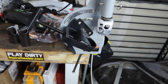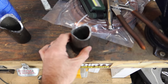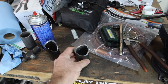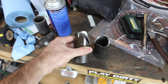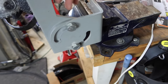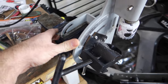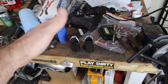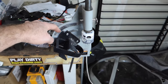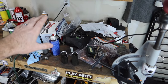I've been making a bunch of notches with it working on the cage for this car and it has saved me a ton of time. I actually went through and made a bunch of templates — I had some extra tube lying around and I made this as the 90-degree, which is just a straight cut, and this is like a 40-degree I believe, and then I made another one that's like a 35. I'm actually using this in a vise. The way this is set up is you can also put it into a drill press, but my Harbor Freight bench-top drill press is not tall enough to fit this in. So if you expect to use this in a drill press like the picture shows on the front of the box, you need a full stand-up drill press — not a bench-top mini drill press — because it will not work.